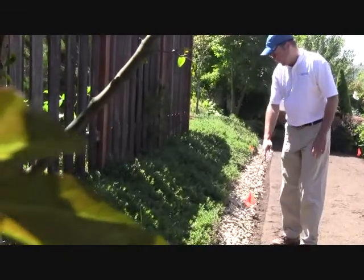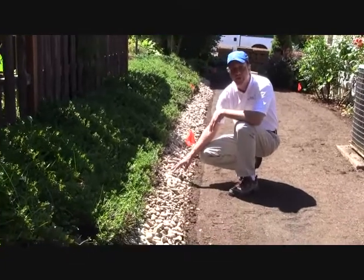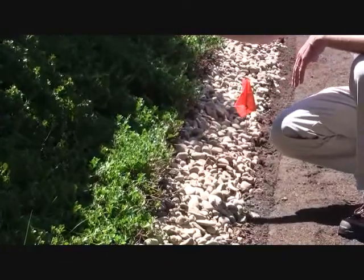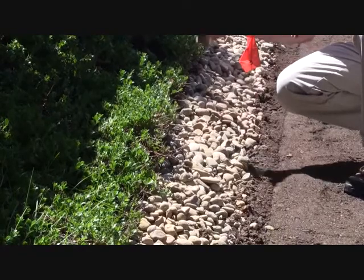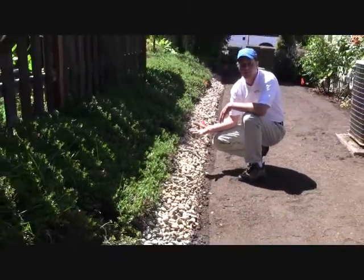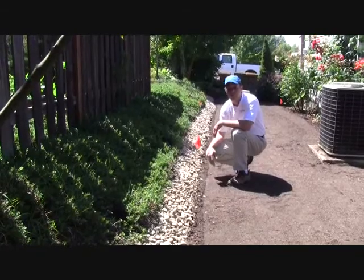What we've done is we've placed this strip drain, which has a hollow pipe buried down between 12 and 18 inches. It's filled with rock. As the water flows down the hill it will be intercepted by this drain line and taken away further down to a drain pipe. So now the only water accumulating in this area will be the rainfall actually falling on the lawn, rather than also coming from the neighbor.